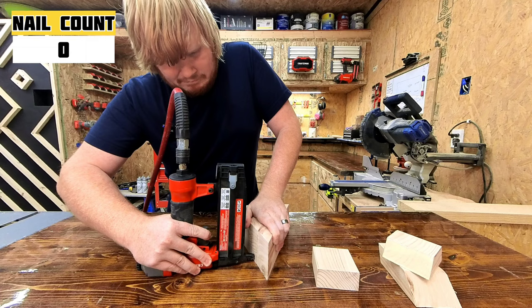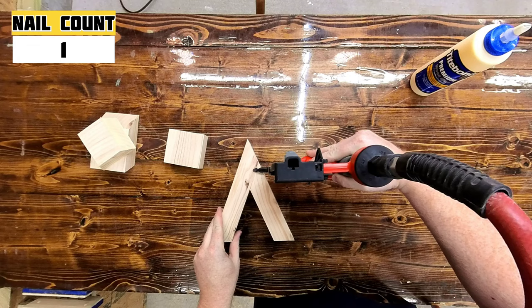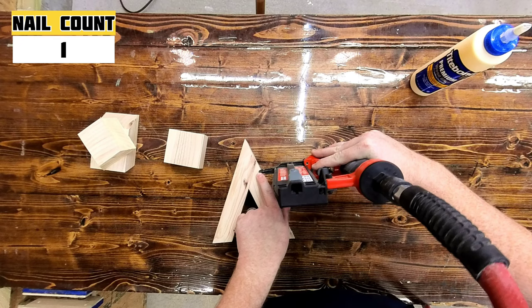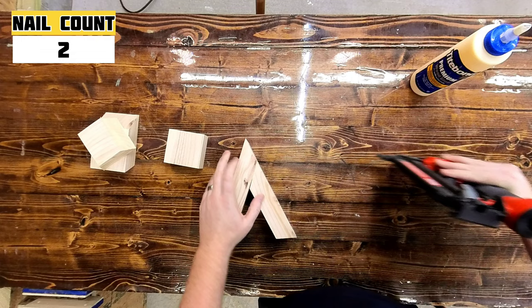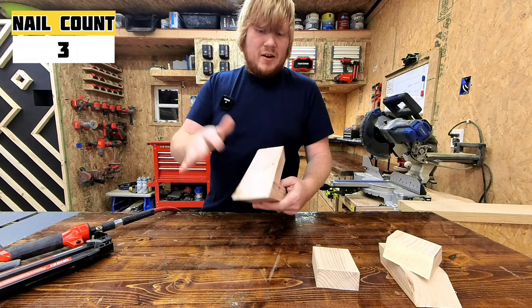I shoot my nails so that they go in right around this area. I like just about a half an inch through this board into the actual material — that way I make sure it has a good strong bond. Three nails into him. You'll see a little bit of glue squirt out, but this is very smooth, so I'm very happy with that. It does kind of wiggle-wobble — we'll fix it in a minute.